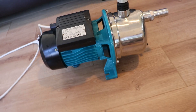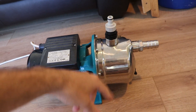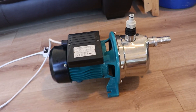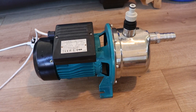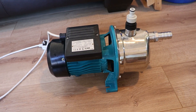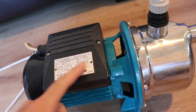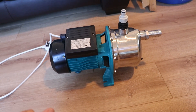This one I've actually been using for a bit — using it to run a hose pipe and water plants with old pond water, which is why it's got the one inch inlet and hose pipe connector on the outlet. And I've noticed it's actually ridiculously powerful, more powerful than my other 800 watt one. So this one's actually 1.1 kilowatt. It still says it's got a 50 meter maximum head height so it shouldn't be too much different from the other ones, but it does seem to be higher pressure. What it might actually be is higher volume, which will also increase the pressure. We've got 1.1 kilowatt, 50 meters maximum head, and 60 liters a minute pumping rate.